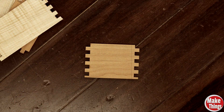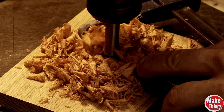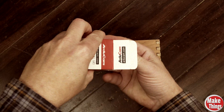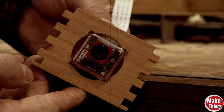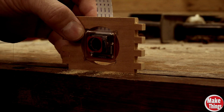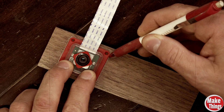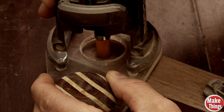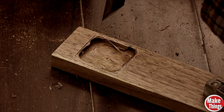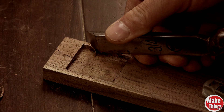Now the real headache — the camera housing. The step-up lens wants a 1-5/8 inch opening, so we drill that out. We yank the camera out of the box. I've seen meatballs bigger than this, but it fits — after we file out the corners like we're jailbreaking it. I make a plate to mount the camera to the box. The holes it came with are so small they're basically for looks. So we do it our way. I hog the walnut out with the router and creep up to the line with a chisel — slow, careful, like defusing a bomb. And yeah, I chip the edge. It's going inside the box. Nobody's going to know.